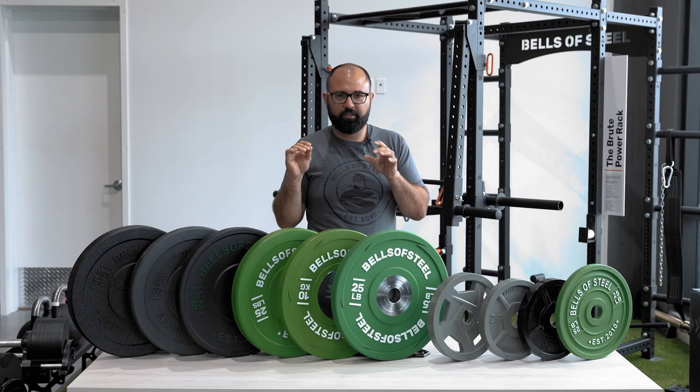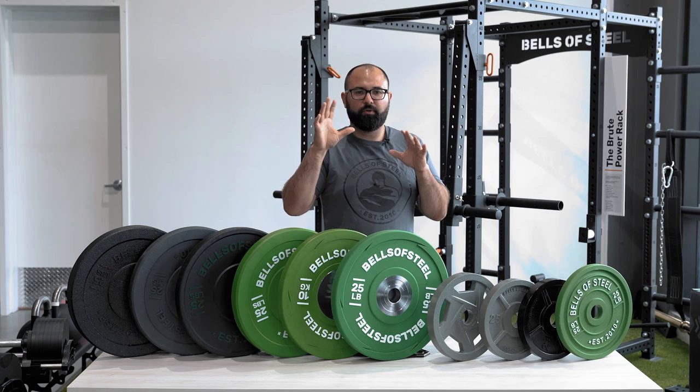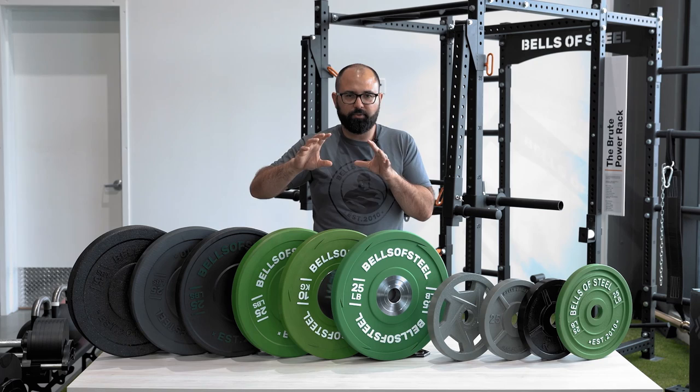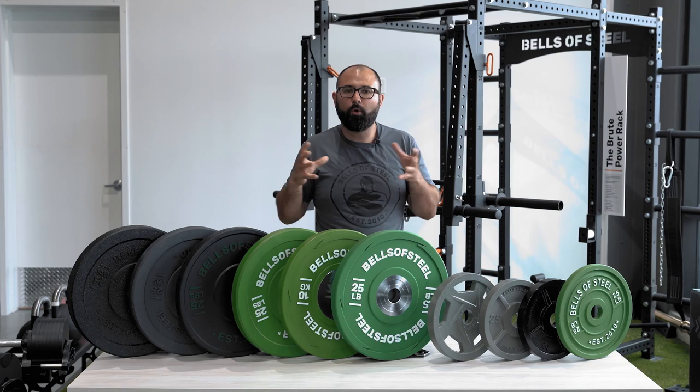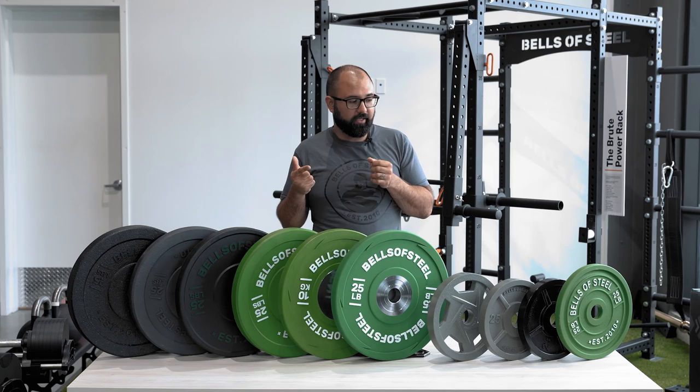To achieve that tolerance, the plate needs to be milled — not just the edges but the back of the plate as well, giving it a cool aesthetic. The next plate is an example of an e-coat finish versus a hammer-tone finish. The e-coat process involves dipping the product into a vat where a chemical process coats it with paint. It's extremely durable and looks really sharp, and that's actually the only difference between these two plate options.